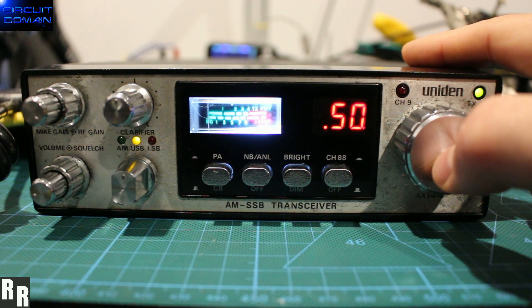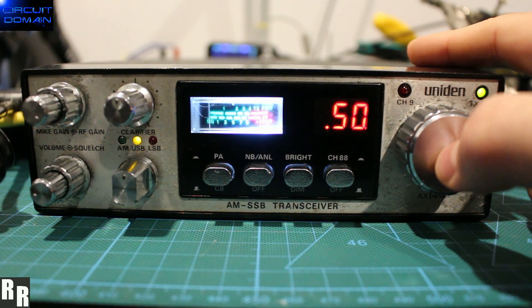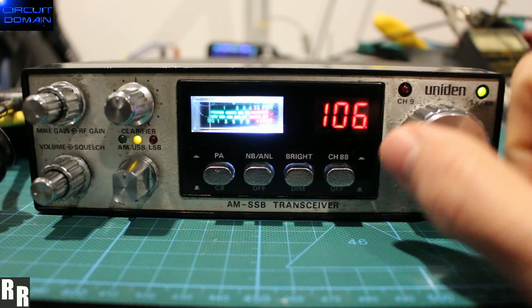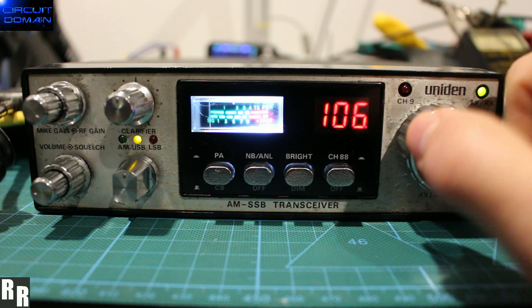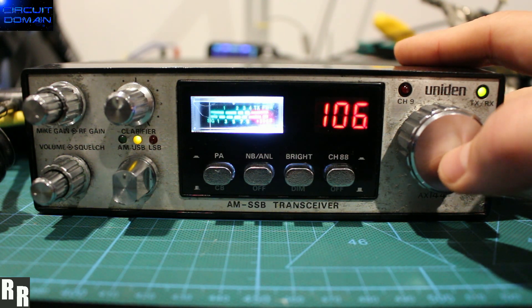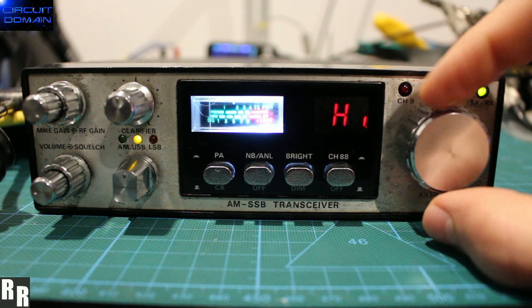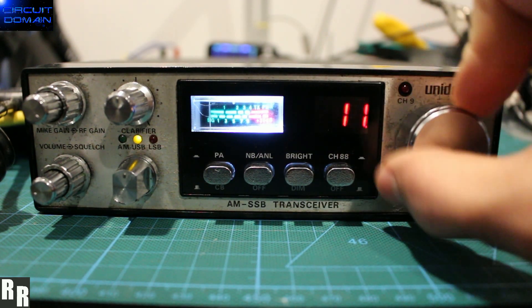For setting up the kit itself: make sure squelch is definitely up because we need that for auto-detect for your lock detector and your channel range. Five button presses to enter setup. Select PLL — for the 8719s, the PLL02As, the UPD858s, and any radio with my RR PLL adapter board, you always choose 106, because that's the MC145106 that I use. Encode for this particular radio is 91. Squelch is always active high in these radios. Home channel — last time I had 555; this time let's choose 38.